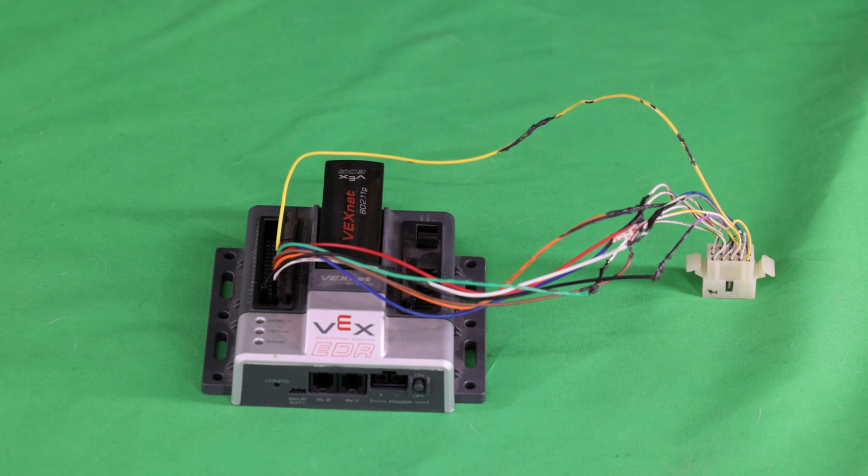The important thing is to use the schematics that I provide in my article for the correct wiring. It's critical that you make the correct connections, otherwise you could short out one of the circuits. The teaching pendant did use 5 volts, but the VEX Cortex doesn't require that 5 volts wire. It just requires the signals coming from the digital outputs of the Hero 1 robot's teaching pendant port, as shown in the schematics that I provide in my article.